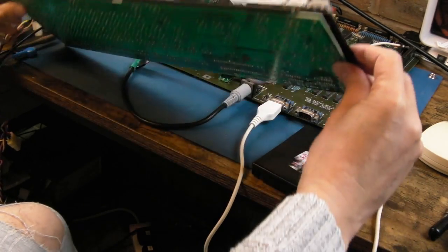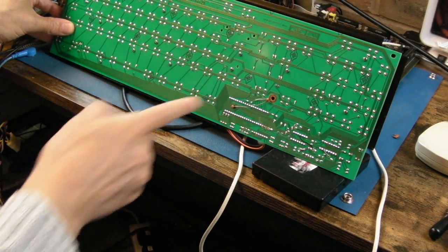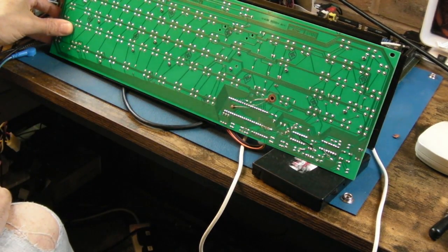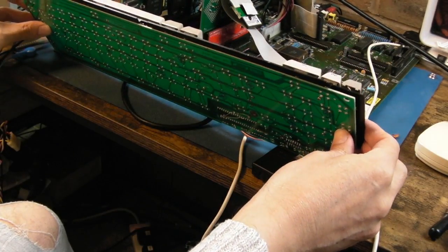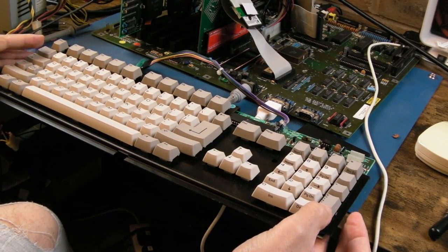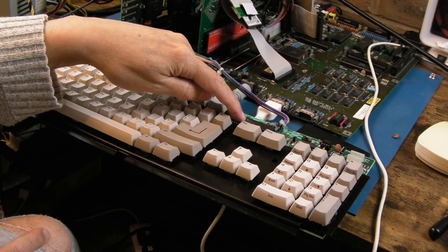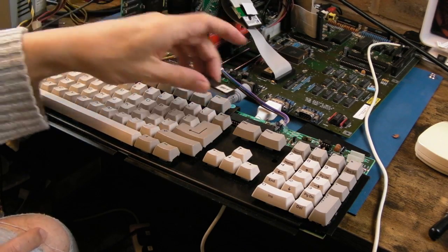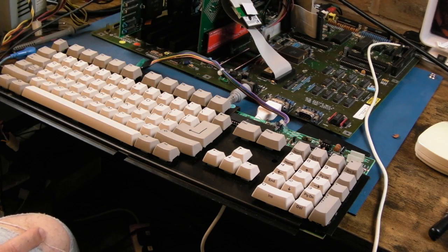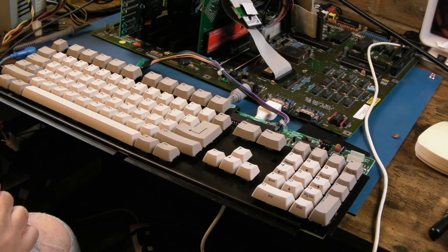Yeah, and if you haven't worked it out, I've just bodged on 2 caps here, across the crystal pins. The later boards have that, but this board doesn't, which means that potentially it's not got the right loading on that crystal. How it would ever work, I don't know. The reason I've wondered about this, and what made me go look at that, is I'm thinking maybe this has got a later revision, because Anthony did say something about this having an earlier version chip, and on the earlier version chip the oscillation was probably done differently. Maybe it had some capacitance already in there for the clock pins. I don't know, but I think that's the issue.